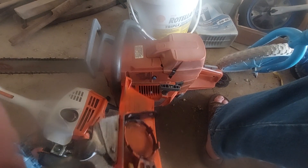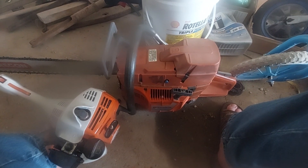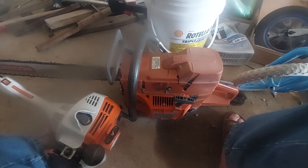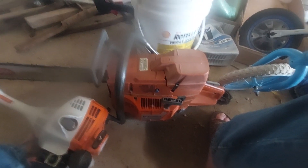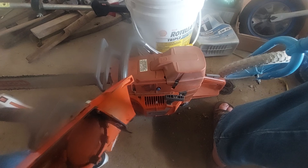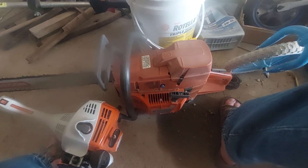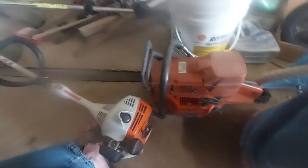This saw is coming apart this winter. My bar studs aren't failing but they're messed up — my bar nuts are hard to get on and off. When I put this saw together the first time I didn't put new bearings and seals in it, so I'm going to go ahead and do that this time. I don't want this saw blowing up. The money I've put into this saw has more than paid for itself, so as far as I'm concerned I have zero dollars in it — and that's why I'm just going to go ahead and split it and put bearings and seals in it.